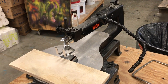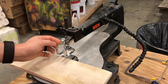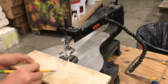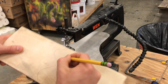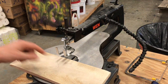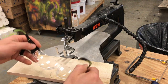First, draw a line that you're going to cut. The cool thing about the scroll saw — and also the coping saw, which is the hand-powered version — is that because of the shape, size, thickness, and flexibility of the blade, it doesn't cut in straight lines as easily as it cuts curves. You could cut almost any shape you want. You can't make a perfectly 90-degree corner by just turning the blade abruptly — you have to make a slight radius in your turn. There are ways to make crisp 90-degree corners, which we'll cover in the three-piece puzzle lessons. But for now, I want to demonstrate how to make a safe cut.